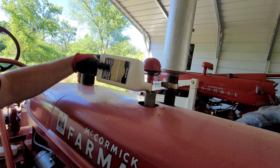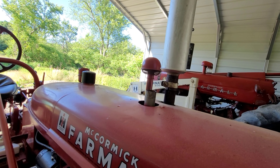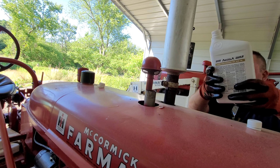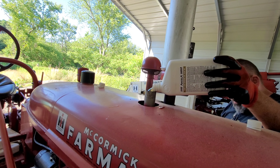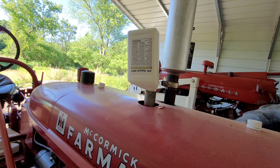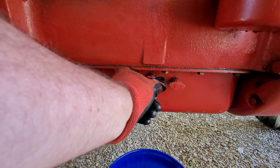This is expensive oil. He told me he doesn't know if he'll be able to get any more in, but I'll go somewhere else that does have it - you can't tell me no place carries low-ash 30-weight oil. I'll add from the other side so I can watch the petcock as well. You can see we're running pretty good, so we're most definitely full.